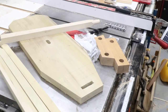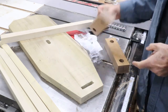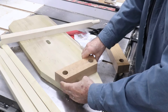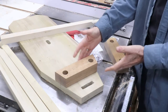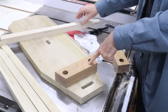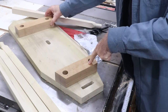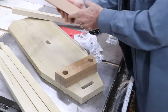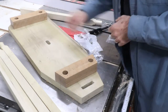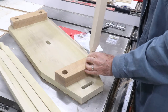You can see the table itself has a taper on both sides, and you want the block that's going to hold the legs to fit that taper. This was the first cut to shape so it fits perfectly in that taper — this edge will be chamfered all around so it doesn't look as rough. The other block goes back here, marked for where it needs to go, and the legs will go in at the correct ten degrees.